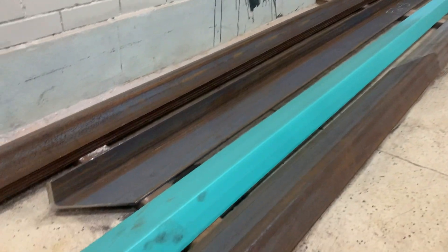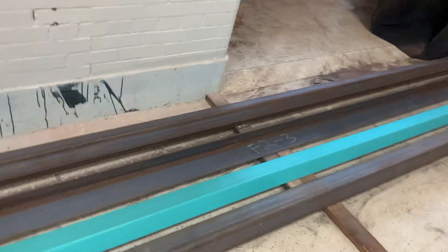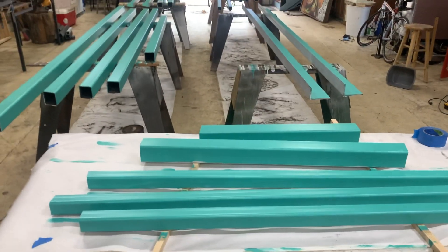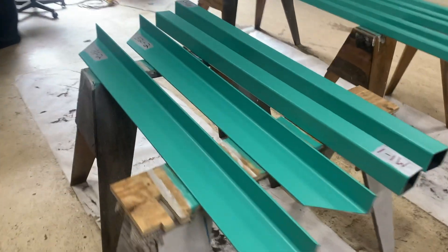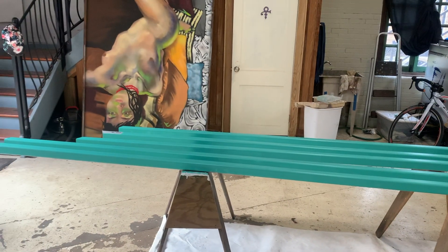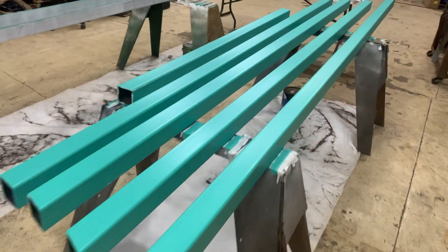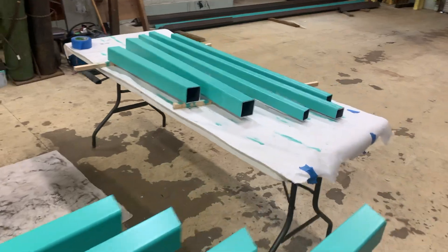We've been slowly working our way through this stack of steel, cutting out all the pieces of our trusses, and as we go we bring them up here and paint them. This isn't necessarily the final color, just something to keep them from rusting. Every piece we cut we catalog — we have a number that tells us exactly which truss it's a part of and where it goes in that truss. Once we're done with a set we bring them out to the building and stage them on the ground, and we're almost through the stack.